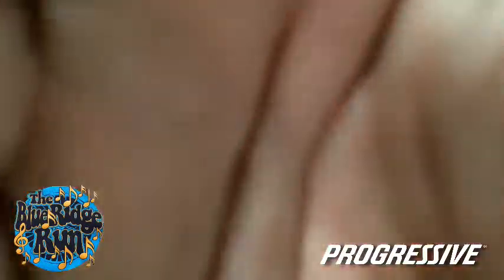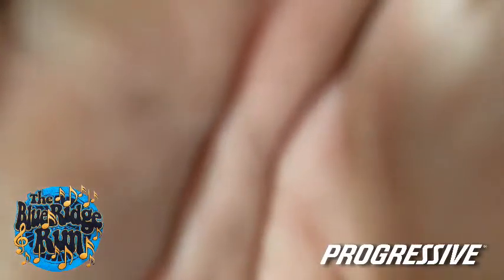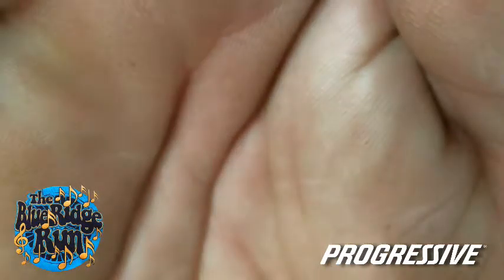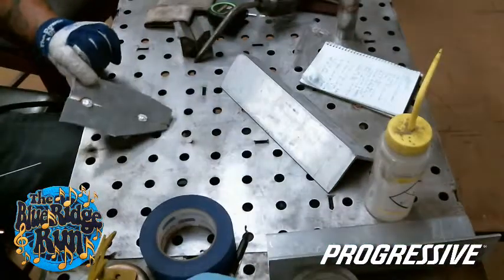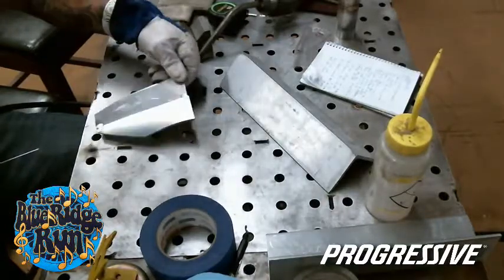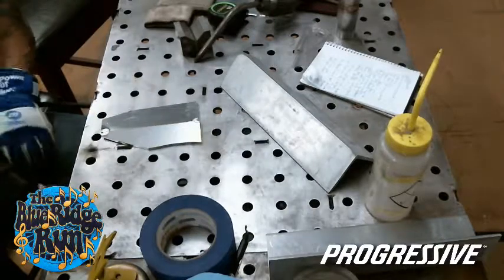When he's talking about the cleaning effect, it's a frosty zone around the weld. It just looks like a frosty white zone. So even tacking that, you can see with just 2 little welds how much that pulls. When it comes to close tolerance work or building motorcycles or whatever, that's a real big problem.